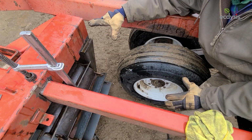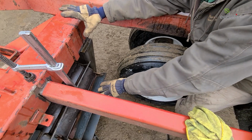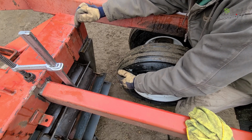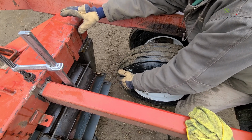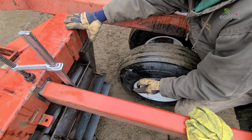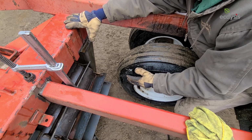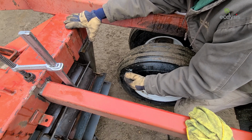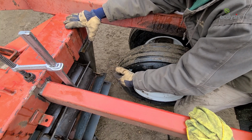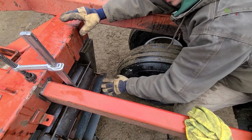The second aspect to watch out for when determining where you're going to permanently affix your wing rollers is the space between the roller itself and your carriage wheels. So we recommend that when you are determining where this wing roller is going to be, put your carriage wheels in the least optimal condition. And that is, in other words, as far back as possible, so that even under worst case scenarios, you have plenty of distance between the blades of your crimper and your wheels.